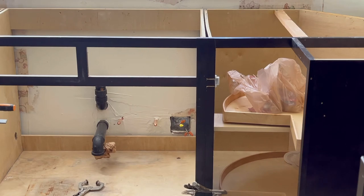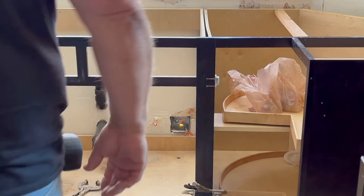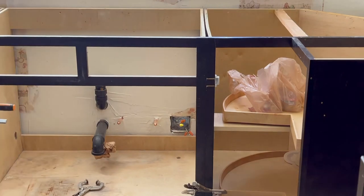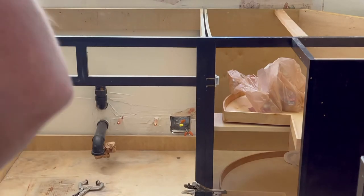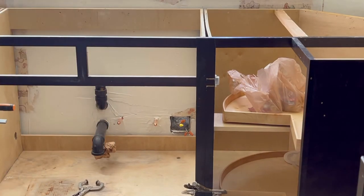This is real flush. Height is good. The bottom's a little off because of that cabinet manufacturer — probably didn't line it up right. This is real common with cabinets today — a lot of hackery. Nobody does anything right; they have all these digital tools and jigs and still screw it up. Using a number 15 star tip, these self-tapping screws go in and you can't even see the head — it's really a thing of beauty.